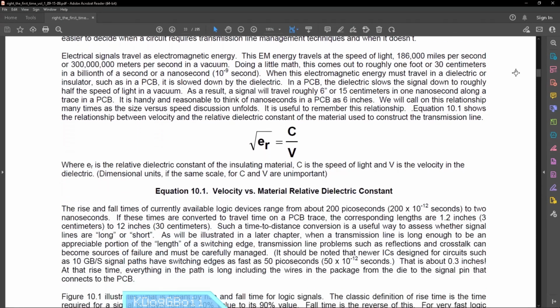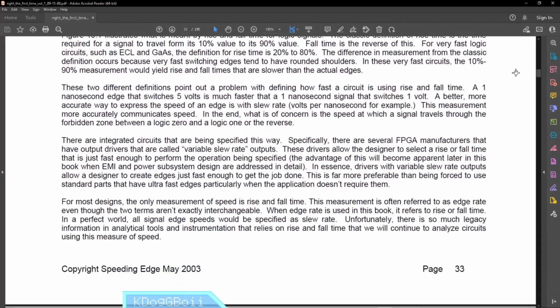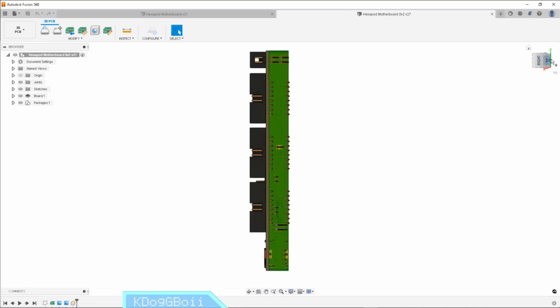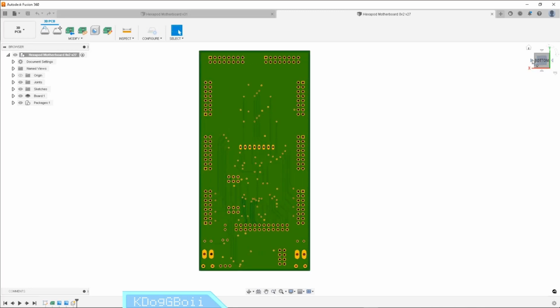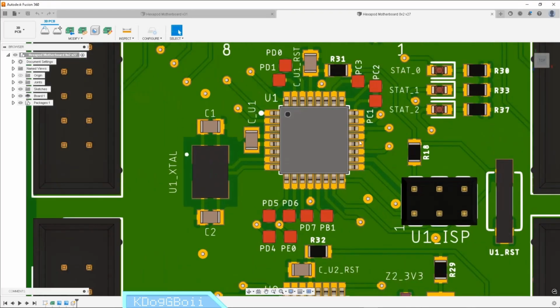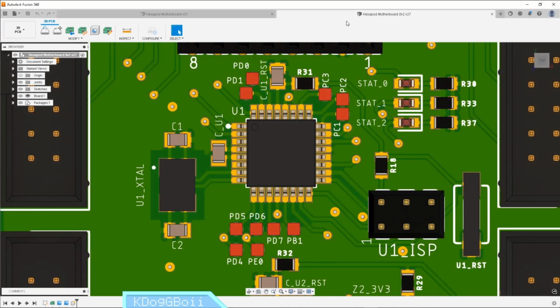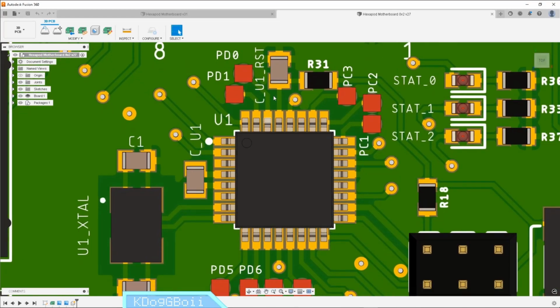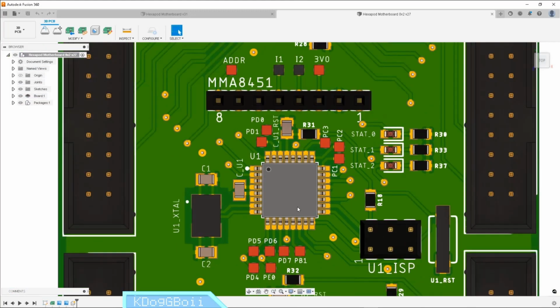Realising that I was the problem, I began watching lectures and reading a book to get more brain good at layout. I've now created a new layout with as many of the lessons I've learned packed into it as possible, and I hope it works because I've dumped near £100 in getting these boards spun. Most of the issues on the layout were to do with poor management of the incredibly violent back EMF spikes and sudden current draw from the new servo motors.